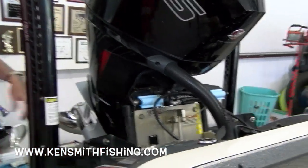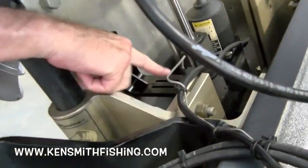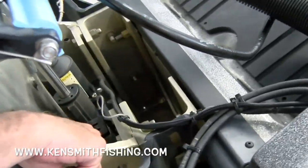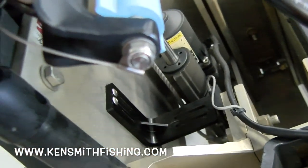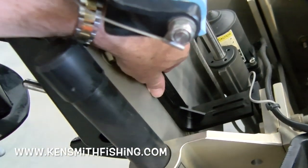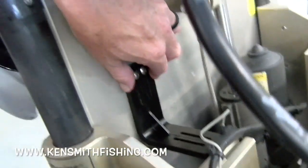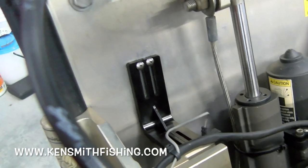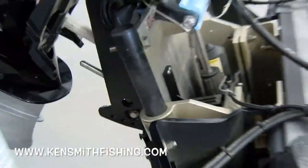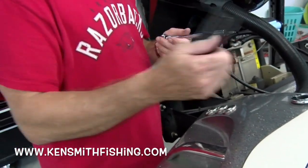Come here and let me show you right here. There's the sensor, and that magnet's right in there. What you're going to do is adjust this. What I've figured out from doing this once already is you want it all the way right there, and you want to bring it up so when the motor's lifted it reads at 20. Let me snug it down. By the way, do not over-snug this or you'll have another broken one.